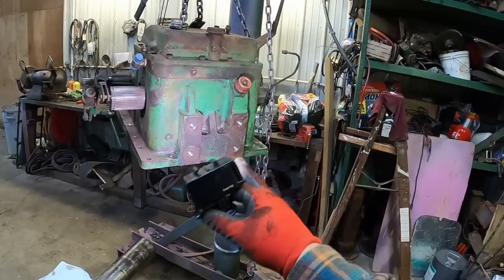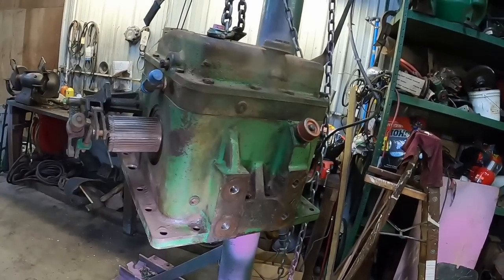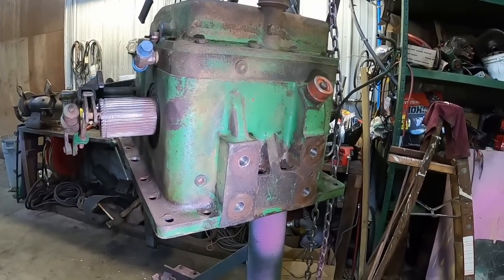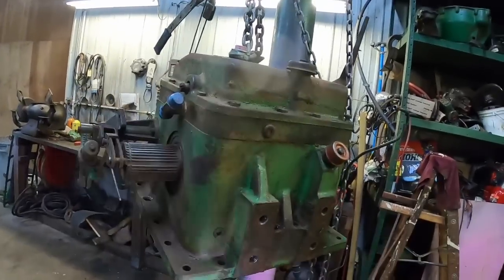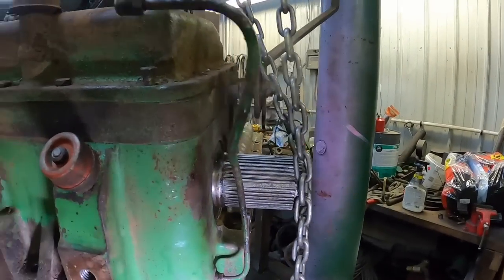I'll do like I did with the 1850. Bolt on with these four bolts, then I can rotate it around. I'm gonna change the lift piston seals. And probably some of these seals that come out, the handle seals, so that I ain't got any, hopefully, seepage.